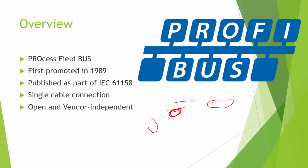The real question to me is, how's it connect to your network, your system of devices? I think I've said this before, but if I am building a facility, I want at minimum the same manufacturer of equipment on everything. I don't care if it's Siemens or Allen Bradley. I just want one of them. And then on top of that, I would ideally love the same PLC on everyone, so that I don't have to have 13 different backup PLCs in stock for when something happens.